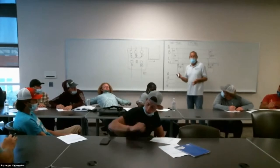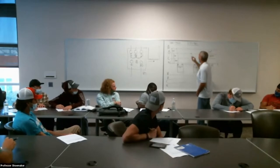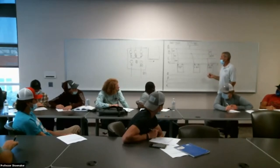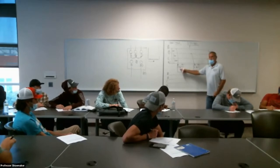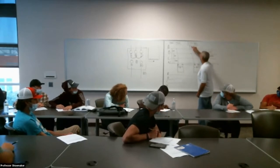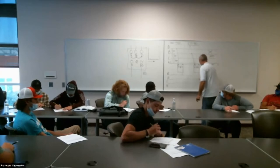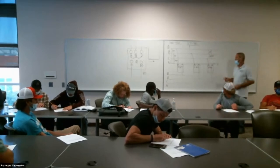How much voltage do I get? Here we go. How many wires come out of each individual transformer? Two. Two, right? Because this one's empty, correct? Okay. So I'll use my right-hand side, and I've got to get 277 out of it. Same as I did at the top. A, B, C. And you notice I use the right-hand bushing every time.